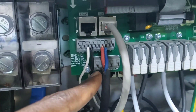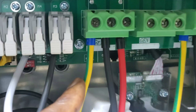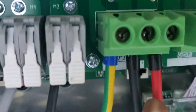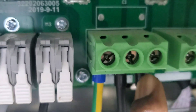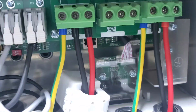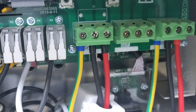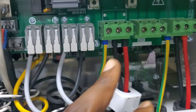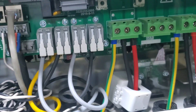We have the generator start function in there already. So this has been a challenge — we had to change all the cables and we went back to the manufacturer's required specification of cables. We used ferrules, so you can see there, there, and there. Tosin had to crimp and solder every one — six times per inverter, so he did 54 in total.